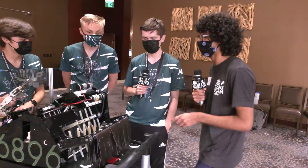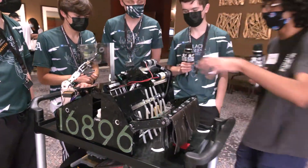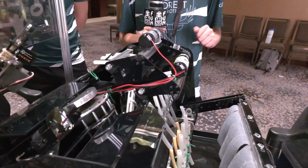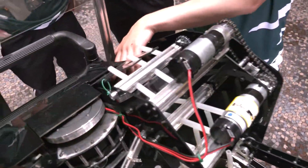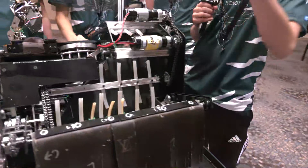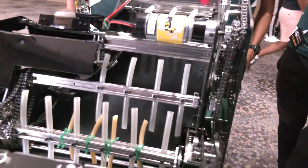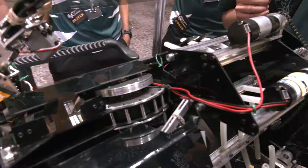Now you've got the ring coming into the intake and going into the hopper — talk a little more about that. The hopper is really simple. There's a servo in here — they stack up all three rings. The servo right down here flicks it in really fast. It goes vertically instead of horizontally, which I think means it doesn't jam as much. Then it sticks it into the shooter, which takes it from there, spins around 180 degrees, and it comes out.